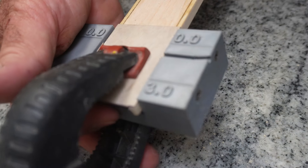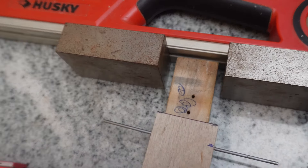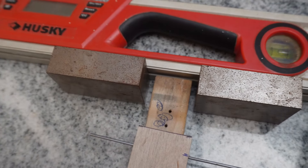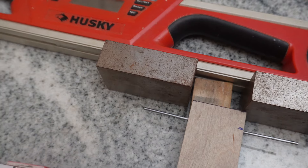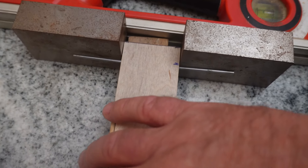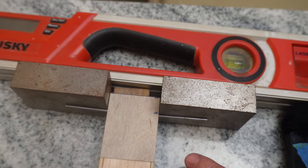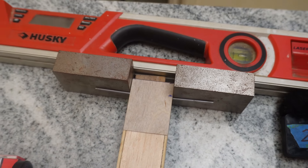The first thing I'm going to do is drill this body, and before I go any further I'm going to confirm the drill is good. I use a straight edge, two pin gauges measured at 90 thousandths in diameter, and two 1-2-3 blocks. I insert the pin gauges, slide the body up to the 1-2-3 blocks, and see if I can see any daylight between the pin gauge and the 1-2-3 blocks. I don't normally put effort into correcting a bad drill — if I see daylight, I move on to the next body.